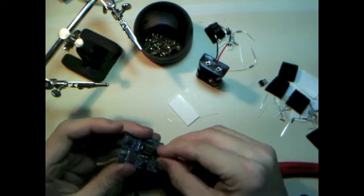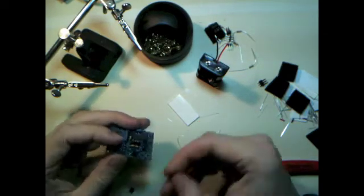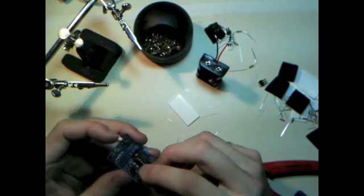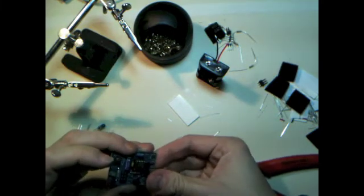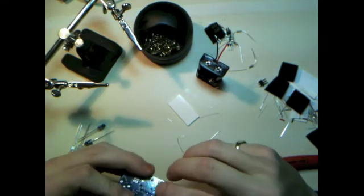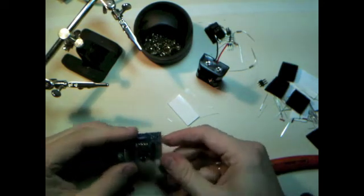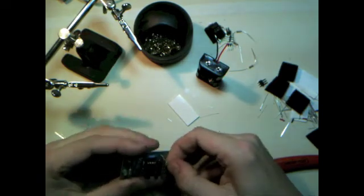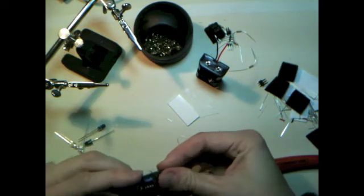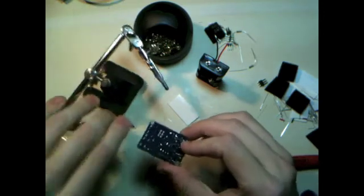Now here we go — these are the 2222s. There's four of them, and these help turn the light on and off. They also manage the power difference: the amount of power used to run this circuit is different from the LEDs, so the transistor lets you run both without frying one or the other. It's much easier to bend the legs in than to bend the legs out when you're trying to get them in holes, so that's why I like to bend them out a little bit before I stick them in.